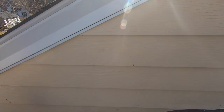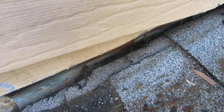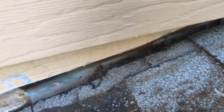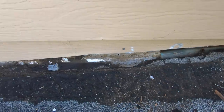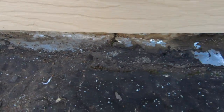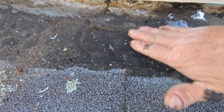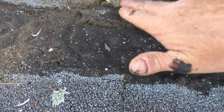So what happens is debris collects there — look at the debris, look at it. The debris collects in there and they couldn't do a proper attachment with a flat roof here. They put tar but they couldn't get to it because it's hard. Look where they put tar here, but they never got the roof right there to the corner.